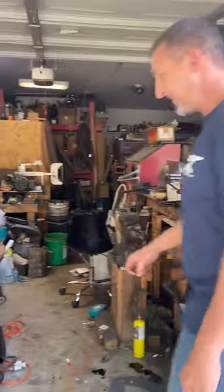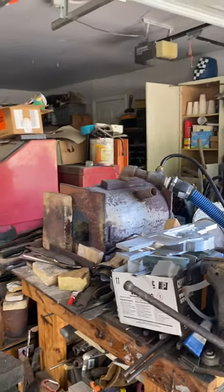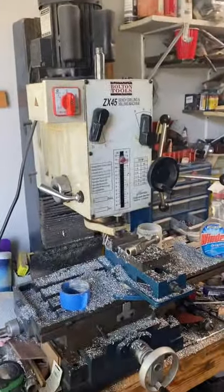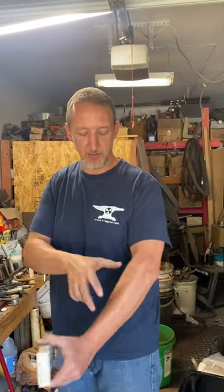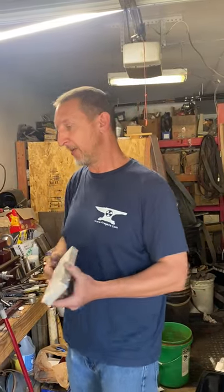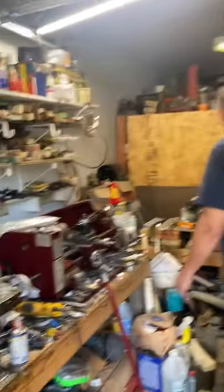I've got two dozen various curvature hammers, so I can put just about any form I need into metal. I also have hundreds of pounds of other shaped metal pieces. I've got an anvil, a forge, and all sorts of other tooling to make what I need. I've got a milling machine — a lot of what I'm going to be doing is getting the basic shape done in sheet metal, then coming back with some thicker aluminum to actually mill in all the fancy shapes and curves — like on the front pieces of the shins, upper shoulder sections, or forearm pieces.